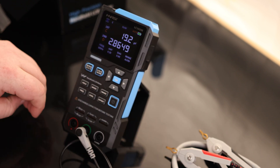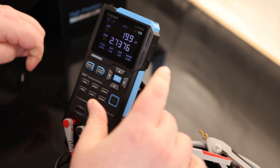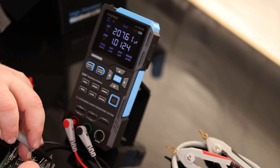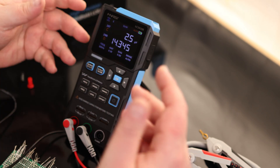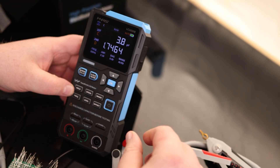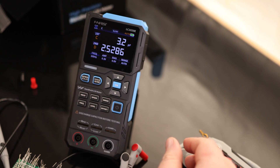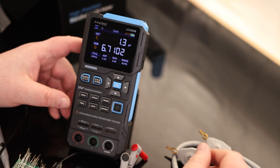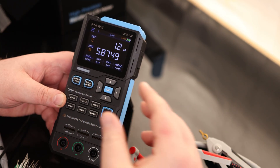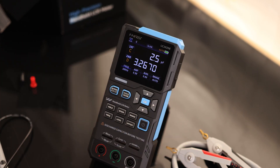Let's use our leads. Whenever you're introducing wire, you're going to be changing the inductance — just something to keep in mind. Reading pretty much the same thing: 208. We've got a whole bunch of different ways to test components. LCR meters — if you're ever doing any kind of troubleshooting on electronic devices, this is going to be one of the most valuable tools to have. That looks like a very high quality unit. I really love how intuitive everything on here is — very simple, very well laid out overall. That is an awesome LCR meter.